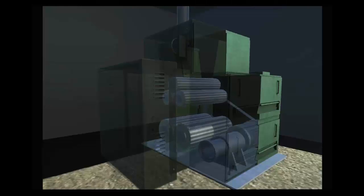When operating roller mills, it is important to ensure that work is divided between the pairs of rolls in an appropriate ratio. The rolls need to be held in tram and parallel. They should be set square against one another to prevent uneven wear of the corrugations, which ensures more consistent grinding long term.